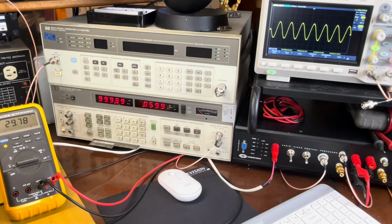These volume controls just got the little clicks, so one click's too much. Try to find in between. And that's a little too high. 0.2, 0.06, 0.1. We're getting there. Let's get right under 0.1. What do you think? You want to push it? 0.09? It's just splitting hairs at this point. Yeah, it's hard to find that exact. There you go, 0.09. We're looking at 31.26 RMS volts.